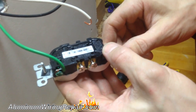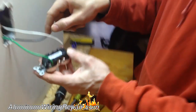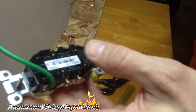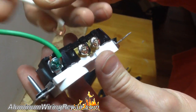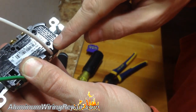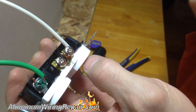Josh is also showing us how to install the Illumicon on the outlet, the receptacle. A long time ago they would use the holes on the back of the plug — just stab the wire in and a little jaw would clamp down on it. But the preferred method is the hook method: make a little hook at the end of the wire and wrap it around the screw. As you tighten the screw it clamps the wire down better. Just poking it into the back of the plug means any little twist can pop the wire out, wires break, and other issues happen.